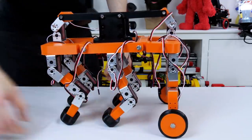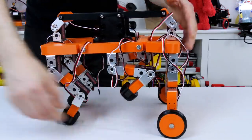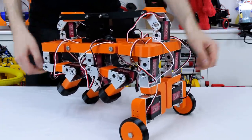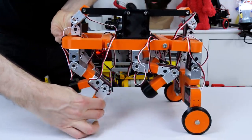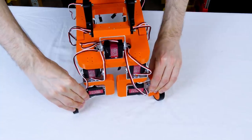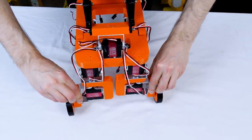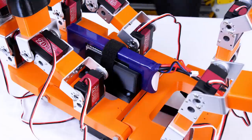The plan is that the middle legs can pick up and down — during normal operation they'll be folded away and the robot will run along on its back legs, steering with the front wheels. The robot is statically stable because it can stand on only one leg and the two wheels, so we don't have to make it actively balance or do anything too clever to get it to function, and that's one of the key things behind this prototype — to make it easy to test out the idea. There are 14 servos and they'll happily run on a 7.4 volt lipo, so I've made a place to fit one in the belly of the robot.